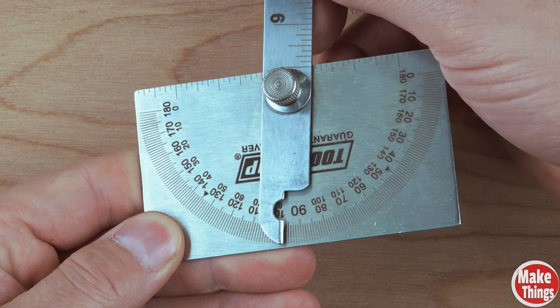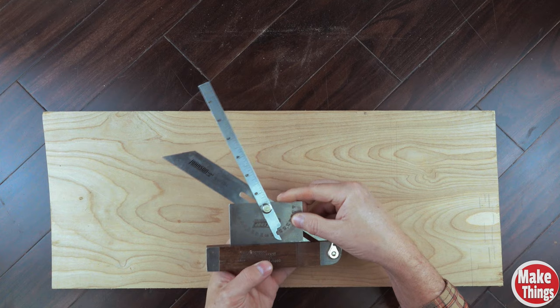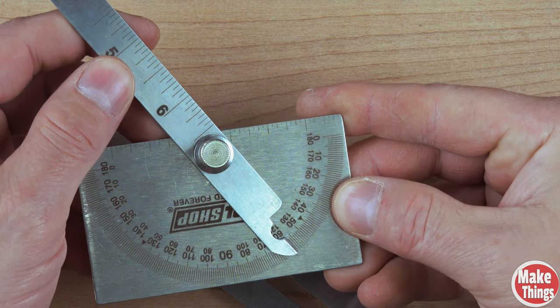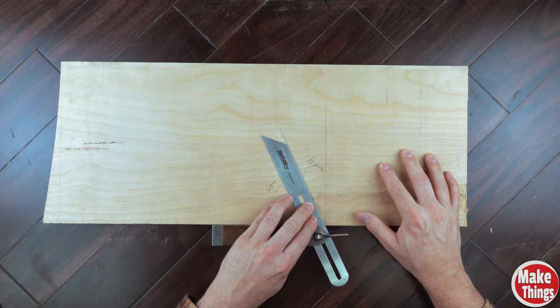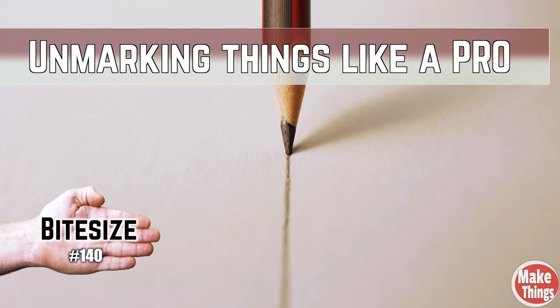If I line up my bevel, I have a 65-degree angle from the edge. The square head works very similarly but doesn't use complementary angles and is actually a little easier. I can add the square head protractor directly against the bevel stock — instead of measuring from 90 degrees down like the speed square, I'll measure from the horizontal edge up to the 65-degree mark. This makes finding angles more straightforward and uses less math. I like using the square head protractor as I don't have to draw lines to use it — just set it and forget it.